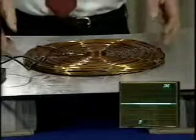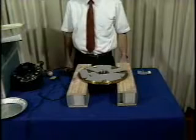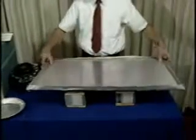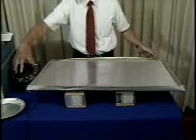Here it is again with a current of 30 to 40 amperes. The coil doesn't lift off, but the induced current does make the ground plane very hot. Our coil has the makings of a burner for a stove — our thin sheet could be the bottom of a pan. Our experiment has been turned upside down, and a protective border prevents spillage.